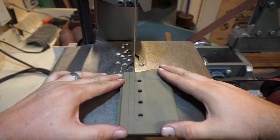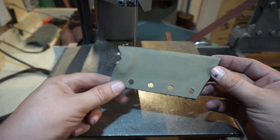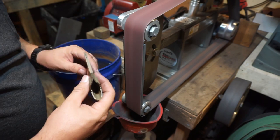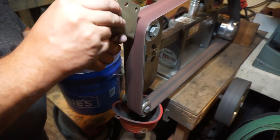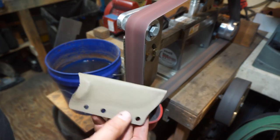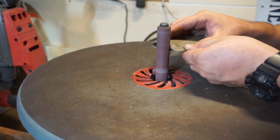When it comes to cutting out your sheath, you want to make sure that you cut on the outside of the lines you draw — that way you can sand or grind back to those lines. We're using a 60-grit belt this time just to try it out. We're going to go around, get everything sanded smooth, get rid of any cutting lines from the porta-band saw, and start rounding the edges to give it a nice smooth shape. Then we'll get into the curved area with the small drum from the oscillating spindle sander, using an 80-grit drum.